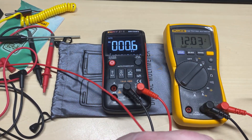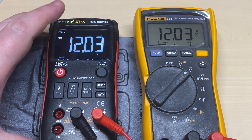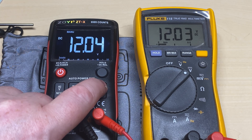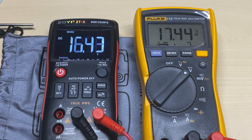We'll turn it on and do a comparison against the slightly more expensive meter. It's reading my bench power supply quite nicely, so everything's good there. You can auto range and manual range it. Millivolts has overflowed, volts has overflowed because we're over 10V — going to that range and yeah, it's showing pretty much what my other meter is showing. We're adjusting the bench power supply to see how quick it responds — it's responding quite nicely. At the top of the meter it says 9,999 counts. It's responding quickly and seems quite accurate.